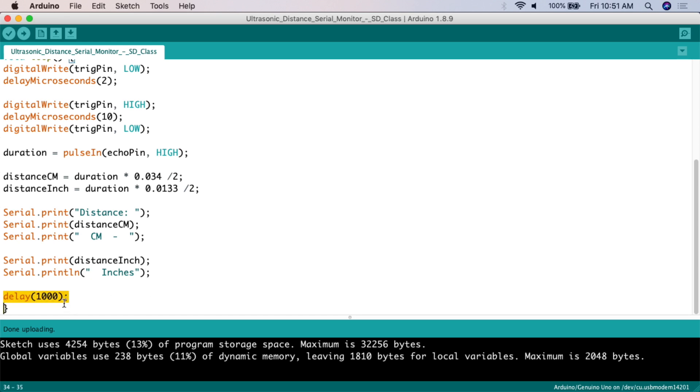The delay here is in milliseconds — we set it to 1000 milliseconds, which means one second. You can set this delay to whatever you want. I set it to one second so I can actually read what's going by on screen. If this is going to be an autonomous vehicle, you'd want the delay to be much lower — maybe 100 or 50 milliseconds — because you want the loop to go through as quickly as possible.